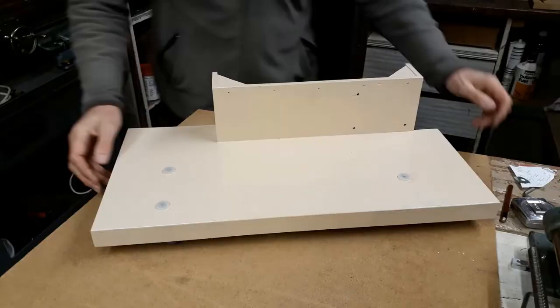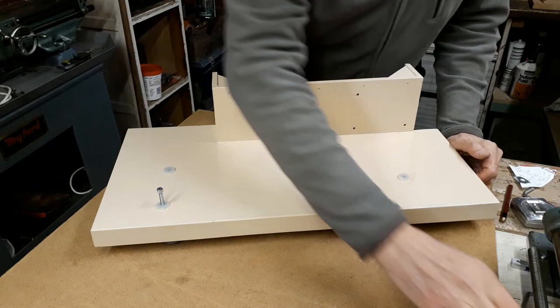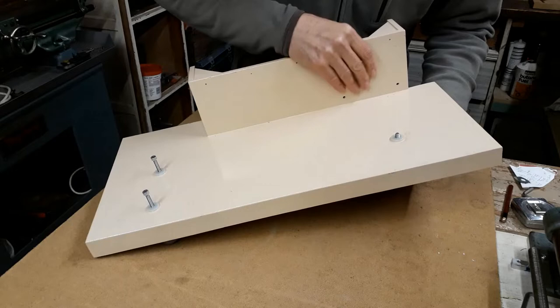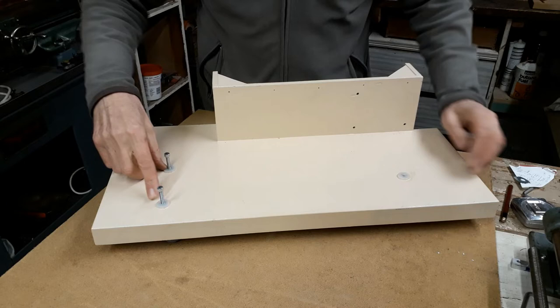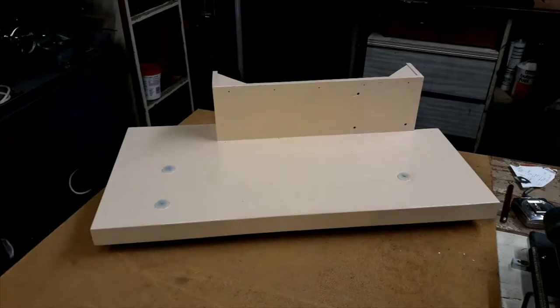Let's take a closer look at the base. It includes 3 nylon bushes. These are mounts for the holding down bolts, 2 5mm which are threaded at the headstock end, and 1 clearance bush at the tailstock for the 6mm bolt which screws up into the underside of the base. These are slightly raised areas, which is of course beneficial. They also provide a slightly soft mounting, and by not tapping all the way through, provide a thread locking feature, which means that you don't need locking nuts.